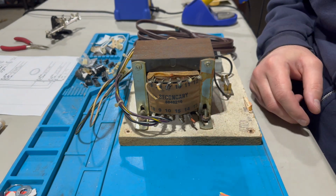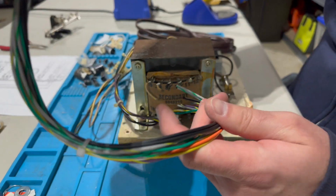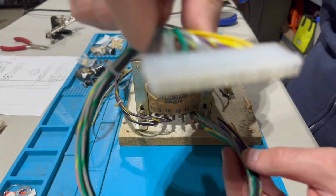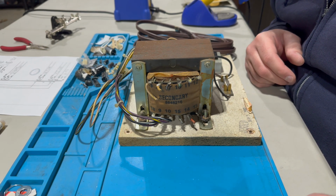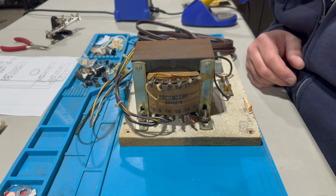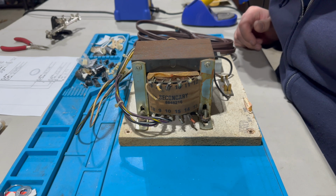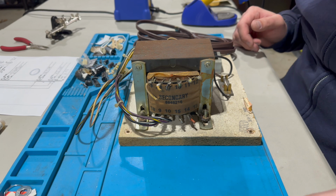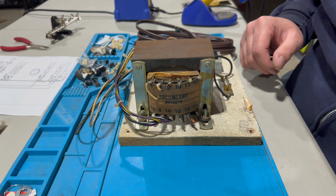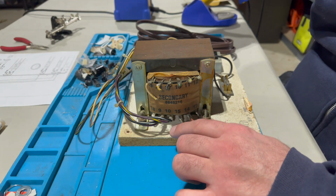then the rest myself. So, I kind of want the connector to sort of go like this, right? Okay. So we've got to make these connections. I've got my, what are these? Gray and green. These are carrying the 11.3 volts AC along with the black, and then the green as the ground. And these should go, and I can even see this on the schematic, these should go to lug 15 on the transformer, which is right down here.